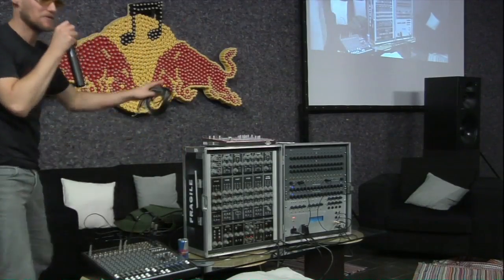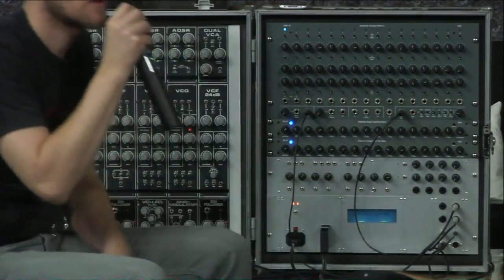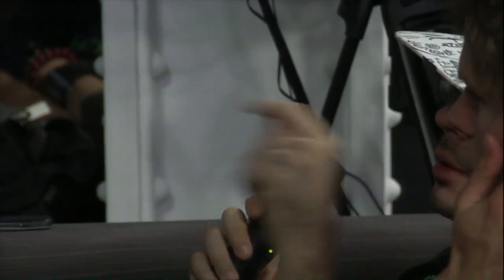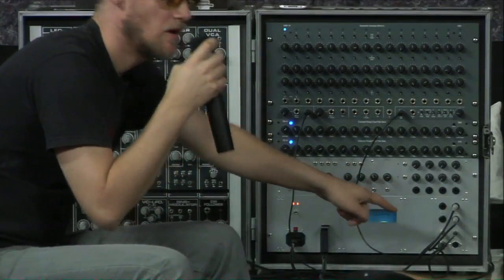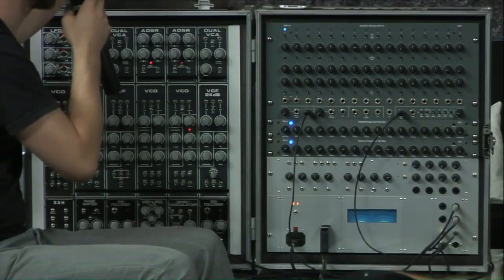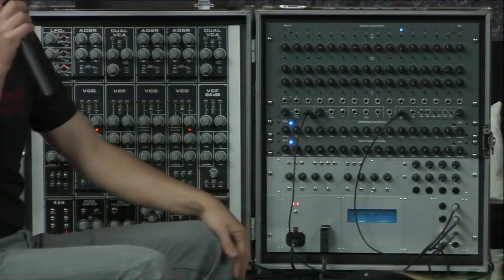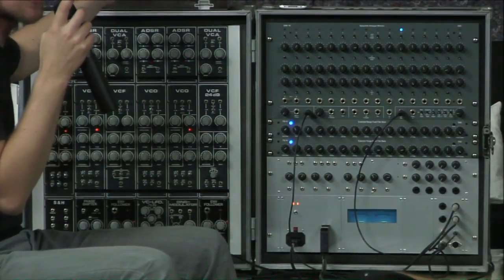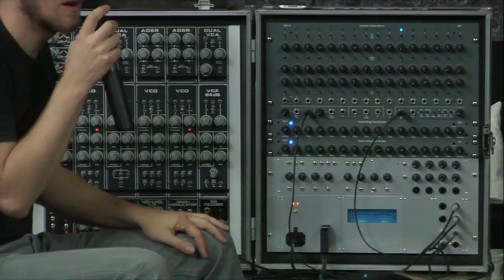Any questions in the meantime about the sequencer, about this first thing of putting in notes? Yeah, I have a question. I didn't get how you connected the drum machine to the thing. Oh, that's just MIDI clock. It's a MIDI out into MIDI in, and basically the drum machine starts the sequencer. It's the master clock. So the drum machine sends out the clock signal whenever I start the machine, and the sequencer runs at the same time. It's a feature that every machine basically has.